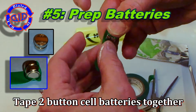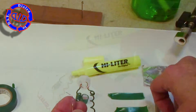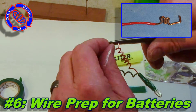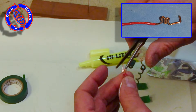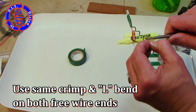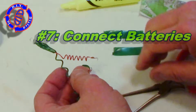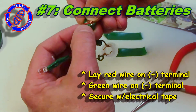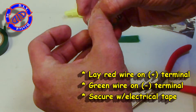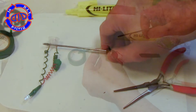Make sure that our wire setup is at least as long as the length of the highlighter itself. Now we're taping two button cell batteries together — each is 1.5 volts, and because we're putting them positive to negative, it's going to add up to a total of 3 volts, which is perfect for the LED I'm using. Since we'll be taping the wires directly to the battery, I like to add a few extra little crimps into them to increase the surface area in contact with the battery. That makes sure it doesn't jiggle loose, then I bend it over in an L shape at the end and put that over the edge of the battery so it doesn't pull free very easily.